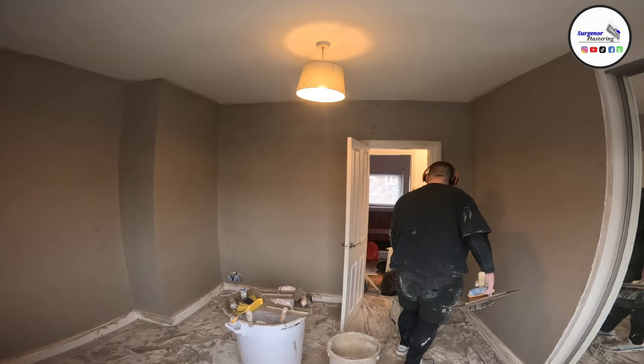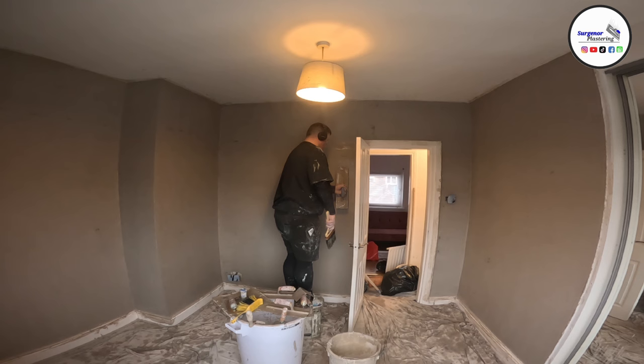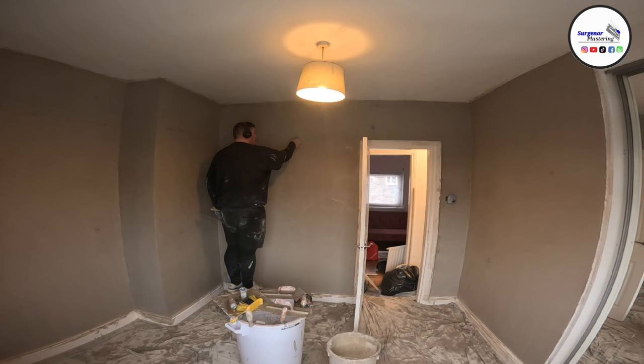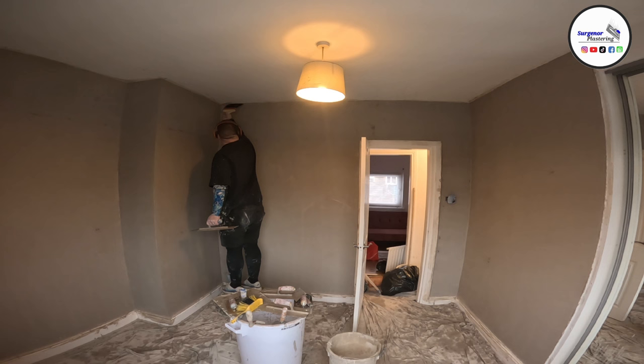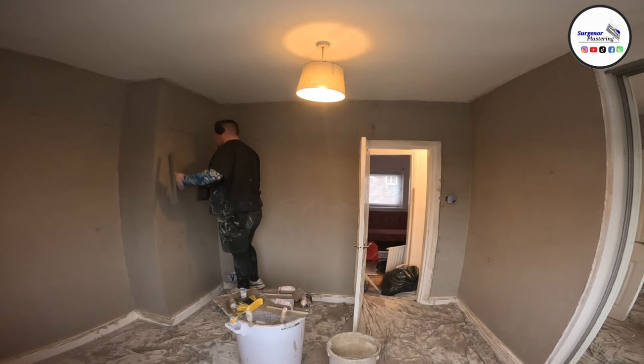Any holes or bumps or lumps should have been filled in the last trowel. If you try to fill it in with the sort of cream that's on the back of your trowel, it's going to look different. You can see there I've had to cut out a little bit of scrim tape that was showing through. I take the hard stuff from the edge of the bucket rather than the stuff that's on my trowel, because the hard stuff in the bucket is going to set the same as the rest of the wall. Really watered down cream from your trowel doesn't actually do that. Not only that, it won't really fill the hole either. Once the moisture starts to come out of it, it sinks in and leaves patches where you can see it's just like a big, dirty, nasty mistake basically.